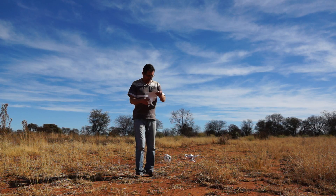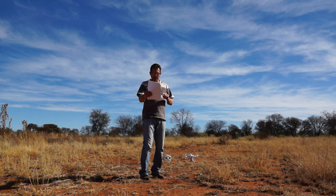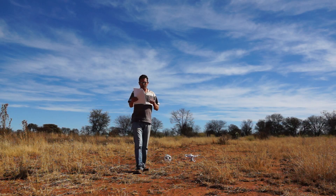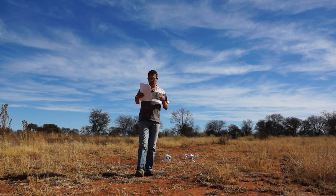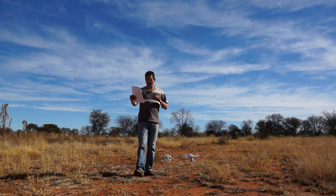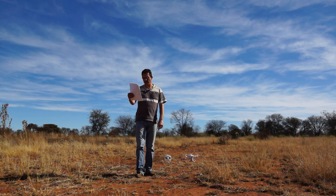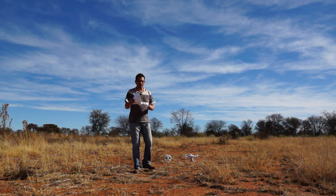Interestingly, in RTL mode the flight controller uses a barometer — which measures air pressure — as the primary means of determining altitude. If the air pressure is changing in your area, the copter will follow that change rather than actual altitude, unless you're within 20 feet of the ground and have a sonar installed and enabled — which we don't. Bear that in mind.